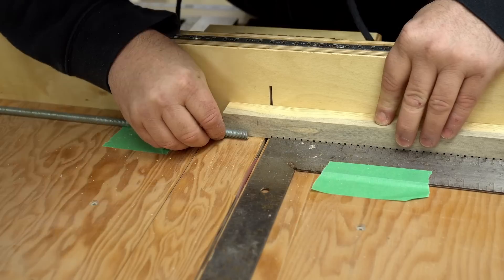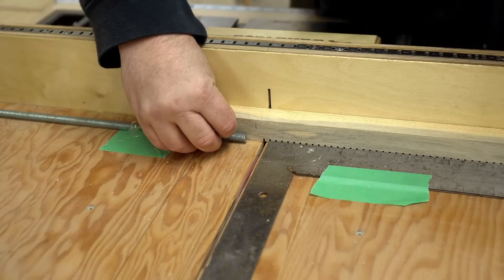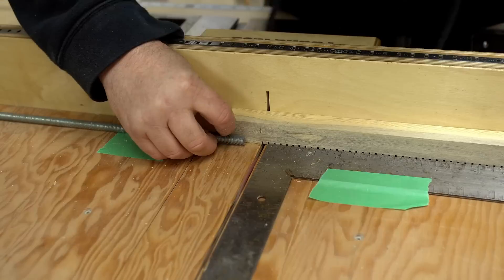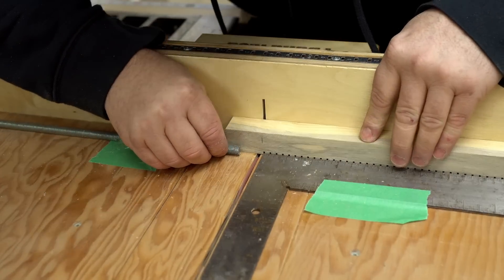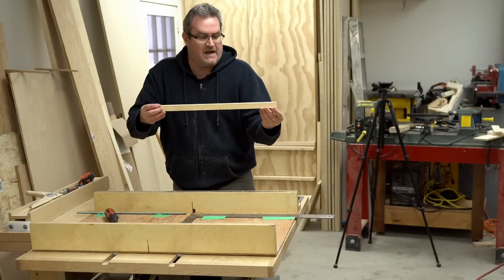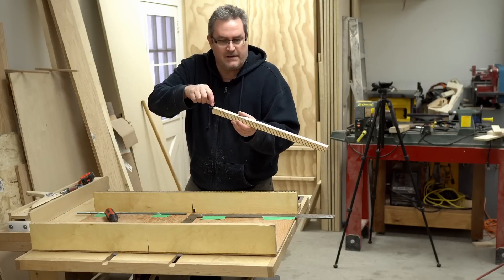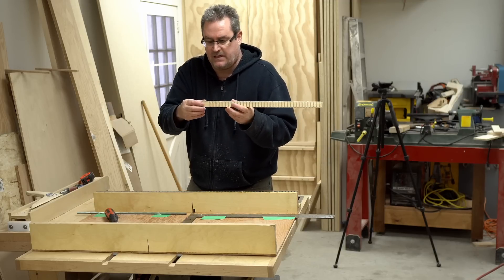I'm coming up on the end — the final few cuts. I know when to stop because I've already made a mark on the rod, which is around eighteen and a half inches from the end. I gave it a little bit extra — I made it eighteen and five-eighths — so I can position the rod correctly in the jig when I'm building it and then trim off the ends after. That was the last cut; I went past my line a little bit, but the important thing is that you have enough and don't cut into that screw on the end, which is why you leave it long.